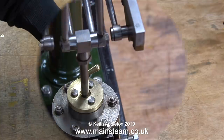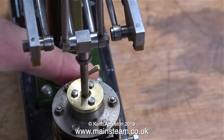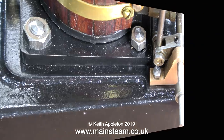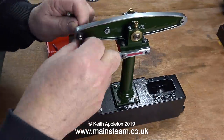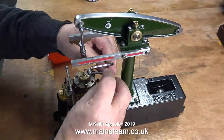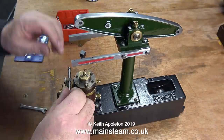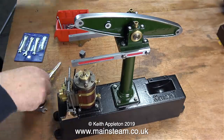Currently I'm making a video series about resurrecting this old beam engine. It was one of a job lot of engines that I bought a while back. I sold the rest of them, but I didn't sell this one because it's too bad to sell. Well, for starters the cylinder's in the wrong place — as you can see it's not in the middle of the casting. The column that supports the beam is in the centre of the base casting, so the beam itself cannot possibly line up with the piston rod. So the builder of the engine had a brilliant idea: he moved the position of the main bearings on top of the column over to one side.